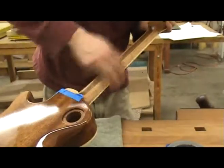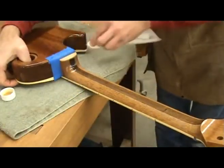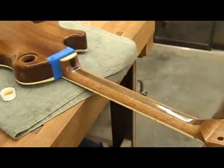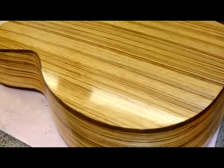Let these dry and then level on the third day before applying a few more coats. I usually stop here because I prefer a very thin finish on my guitar neck. If you prefer a thicker finish, then keep going until you have more build like I'm showing here in the pictures. Basically, when you are happy with the way the finish looks, then you're done.